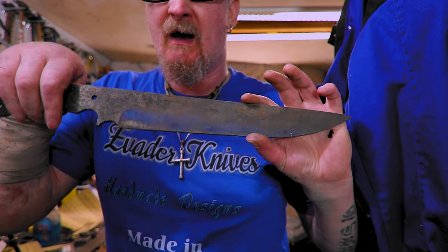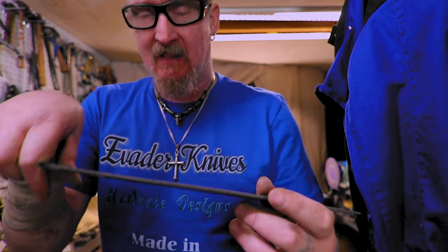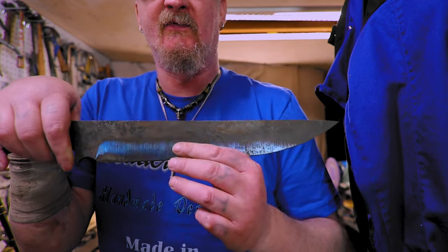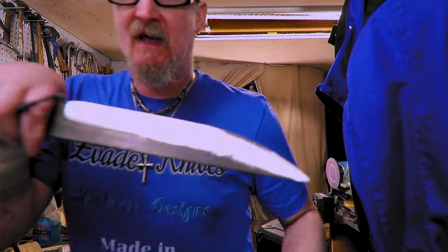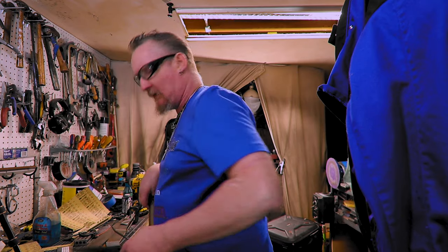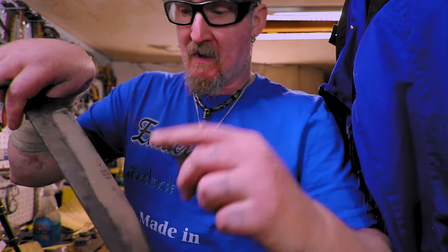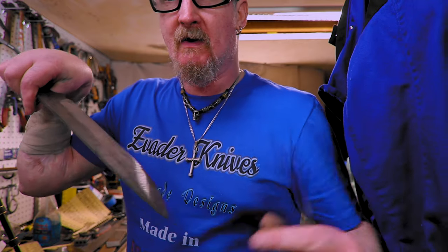Let's go test the machete. All right, so if you follow me on Instagram, this is the second time I heat treated, I had to put it back in and all that. Now the first time I tempered it after the first heat treat, I came down at midnight and just turned the oven off. So I think when I tested it, it was a 55, but I tested these and I cleaned off the bevel. So this seems to just be a surface thing, because this is between a 60 and a 62, which I put up on my tester and they were between a 60 and 62. And this one, here's my 65, which skates, you know, so we're good.